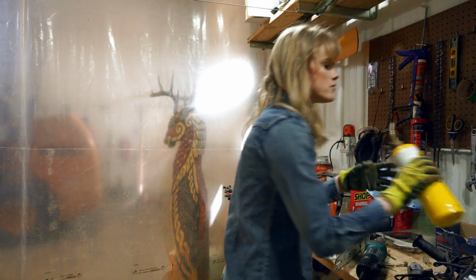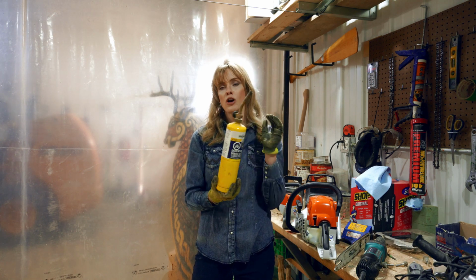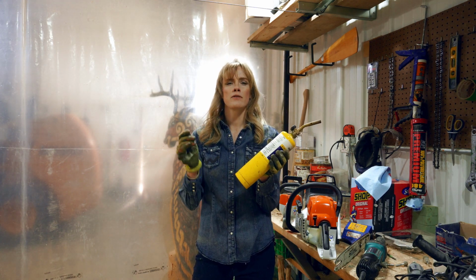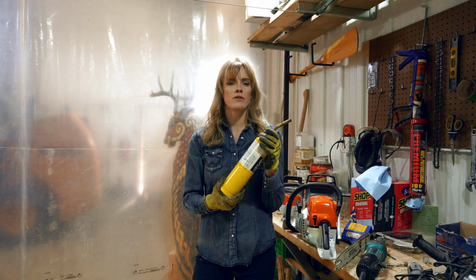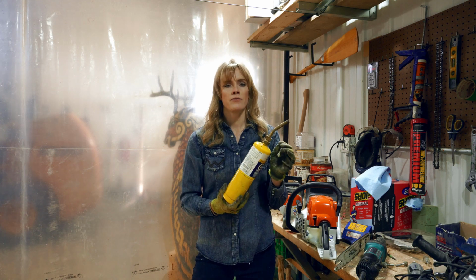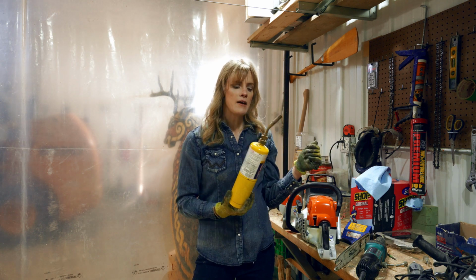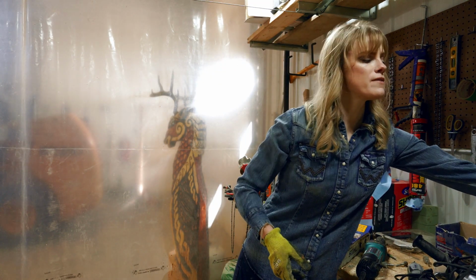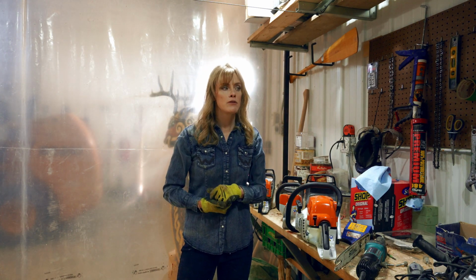And the last thing, it's not really a power tool, but I use it a lot, is the propane torch for adding contrast to the wood. It also helps close the wood grains, and burns away all those little fuzzies left over from chainsaw carving. I usually go over most of my carvings and give them a base of contrast, like on all the shadows or places that I want darker, even before I stain or oil the carving, and it just adds that underlying emphasis of the contrast that I'm looking for. If you overdo it, you can always sand off a little more of those charred areas. As for propane torches, from what I've been told, the yellow bottles burn a little bit hotter than the blue bottles.